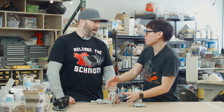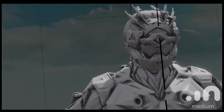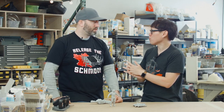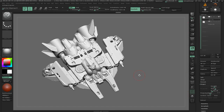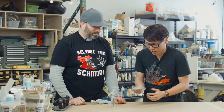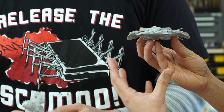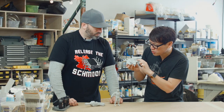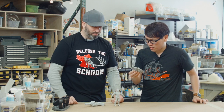I'm trying to figure out the whole workflow — why did some things work so well and others were such a pain? Because they're leaky models. If I look inside this armor creation it's hollow — it's literally as if there's an empty form. It's not like a physical mannequin where you're putting pieces on; it's empty and floating. While they may seem connected, there's no volume there, so no infill. ZBrush reprojection helps — if I leave my original form inside it'll help. I'm still working on the workflow, but we were able to figure it out and print these amazing 3D prints. The detail retains so much of what you sculpted — the greeblies, the shrouds, even the holes that go all the way through the ship.